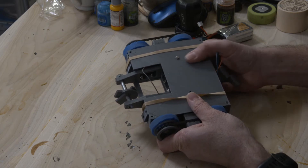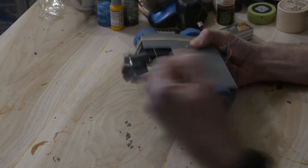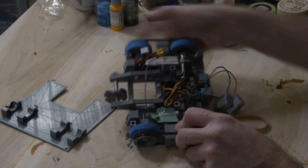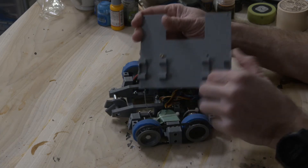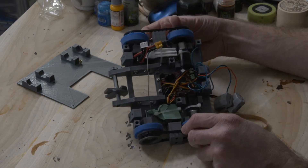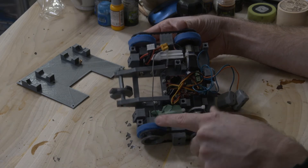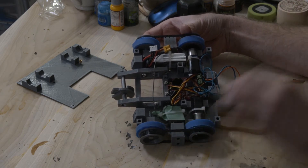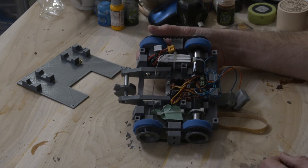Third thing: let's talk about the fact it's held together with rubber bands. So let me open this up. What I should have done early on was actually test fit some pieces. I have these six posts in the robot, and the idea was that the top lid would screw into those posts such that each post would have a little hex insert. I've got one attached to the lid — this little brass hex insert would be in each post, and then a screw would screw into it. However, I didn't test to make sure that the hex I modeled in Blender actually fit the hex piece. Because of that, the whole system didn't work in this prototype and it was held together with rubber bands.